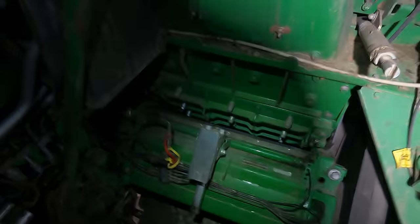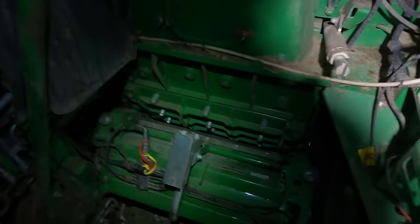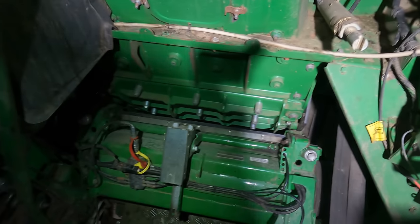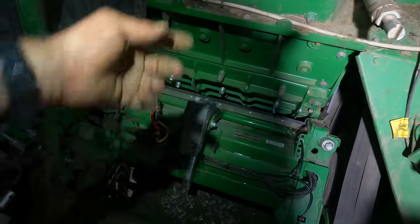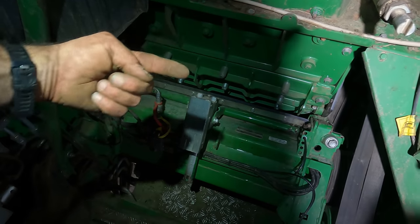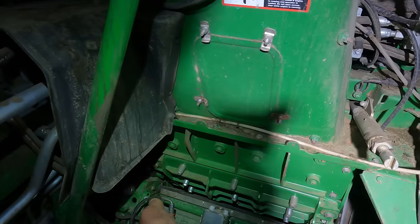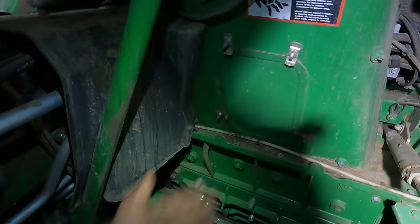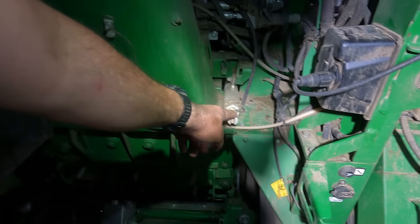Well, we've got this all setting in there. Now, the position that it's in right now is it's out of the channel where the corn can actually come into it. So when we go to do hay, we'll roll this back out of the way. Right now, we've got to roll it in so that when the corn comes through the front of the chopper, it'll go through the KP and then up through the blower and out through the pipe. So right now it's in there like this. It's gonna flip just about upside down so that the corn can go through that other side. So what we have is a little crank here that we're gonna hook onto this turnbuckle and we're gonna crank it into place.